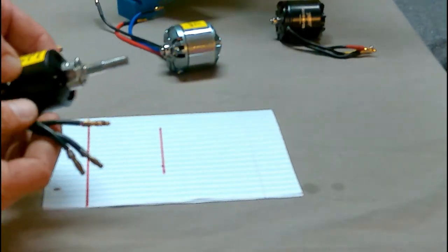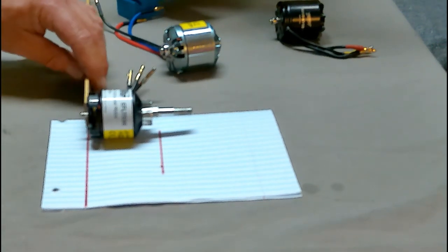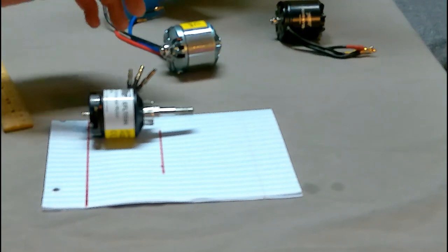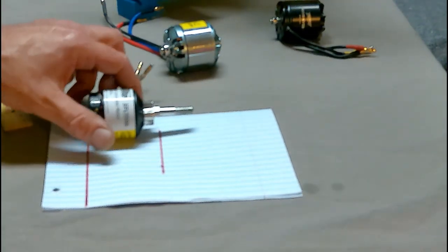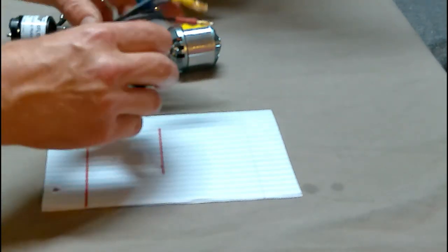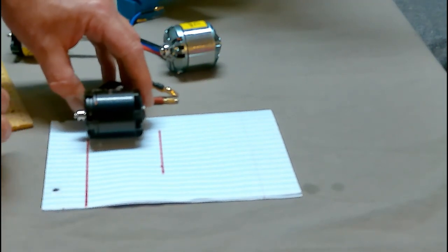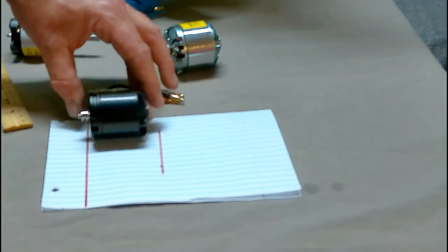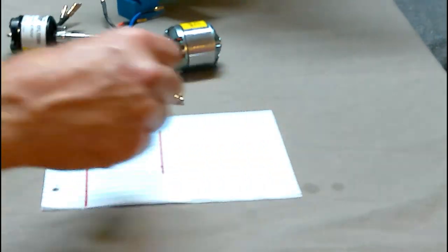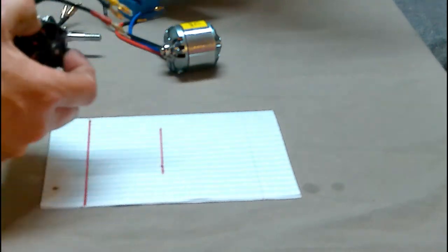Here's my artwork: this red line on the left is the firewall, the line on the right is the cowl — that's our two and three-eighths. The 4250 motor — this is what we stuck in the front — considering the mount behind this motor, still got about 10 millimeters or something. You can always get a prop adapter that's not as thick. This is a 4260 — without the prop adapter on you can see a huge difference. If you put it all the way against the firewall line, you've got all kinds of room. Considering the motor mount, the cross — keeping all that in consideration — you've still got room. So a 4260 is doable.